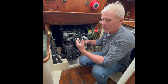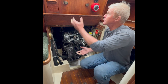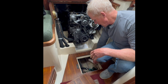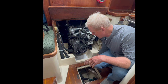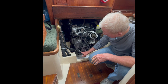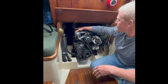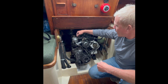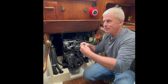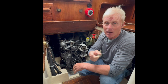The coolant can get warm and unlike a car where you have a radiator exposed to air, a marine engine doesn't have a radiator and there's no air coming through to cool it. So you take water through this water inlet here — I've shut this off because I'm working on the boat, that's rule number one — and this pump will draw cool water up and pump it through the heat exchanger. The coolant internally in the engine circles through here, gets cooled by the raw water via pipes, and that keeps the engine cool. That's the concept as I understand it — if I've got it wrong, please let me know in the comments.